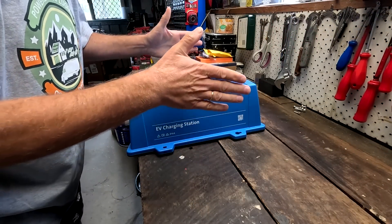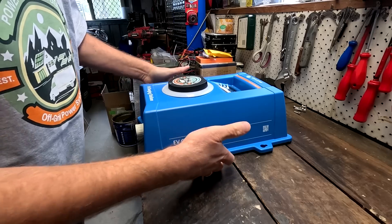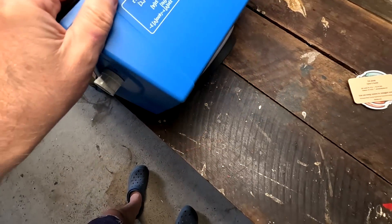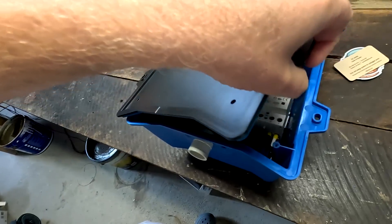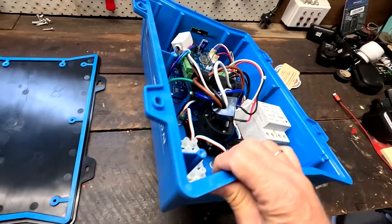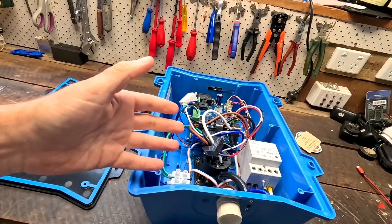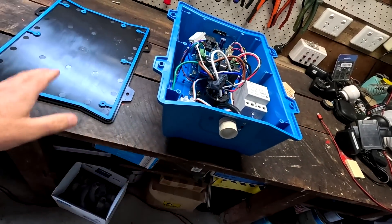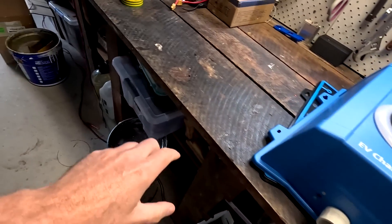The first thing I noticed is there are no external screws anywhere — once this thing is mounted on the wall, you cannot open it unless you take the full station off. You've got four mounting points on the wall, and turning it around you can see many holes on the back. All the electronics and connection terminals are inside the lid, which means this is a two-person job: someone holds the station while you feed in the cables, connect them to the terminal, close the lid, put all the screws back in, mount it to the wall, and then connect your supply cable.